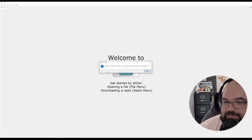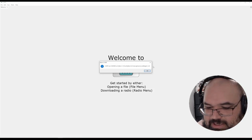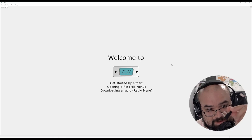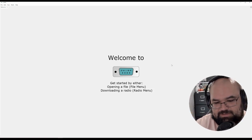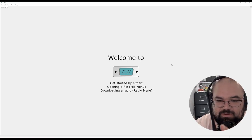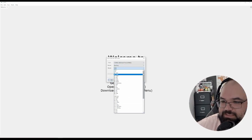I've just downloaded the latest CHIRP — CHIRP Next 2024-1003 on Python 3.10, WXPython 4.2 Phoenix on WXWidgets 3.20. I'm going to plug in the cable. We're going to start with the UV-5R, since that is the quintessential $18 radio that can do anything. I believe this is the UV-5R programming half, so you literally just plug it in. Let me turn my UV-5R on — I believe this is a genuine UV-5R. Plug our radio in, select COM port 22, select Baofeng, select UV-5R.